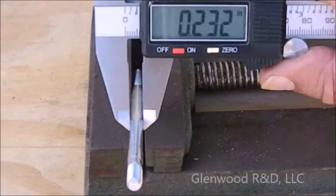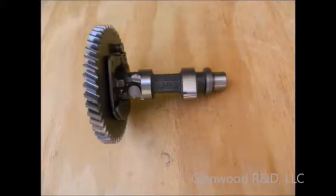It should also be noted that a few extra thousandths of an inch in the diameter of this material are not going to affect the performance of a steam engine. The length of your round stock should be at least that of the camshaft to assist in positioning and securing of the material during brazing.